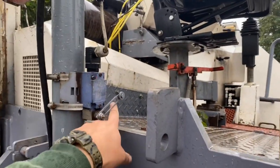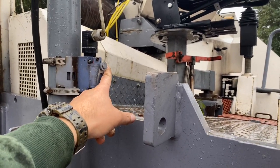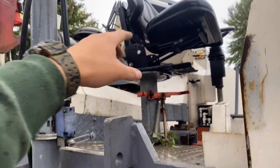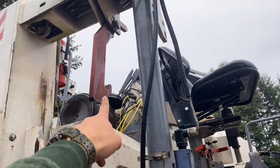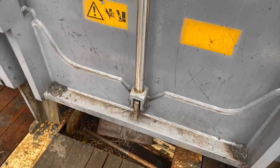Always remember the safety switch here. If you have this door up too far, the switch is activated and then none of your controls up there work — like your depth, your auto-grind features and stuff like that — so it's something to keep track of. When you have this door all the way up, there's a safety lock here, and you'll be able to gain access to your spray nozzles for the water.